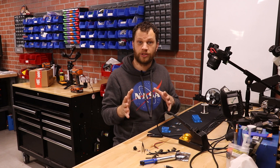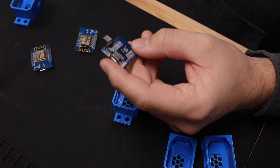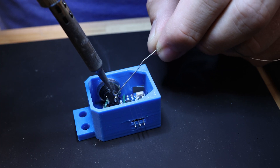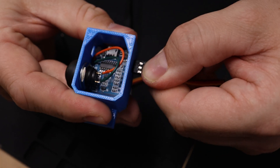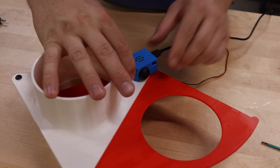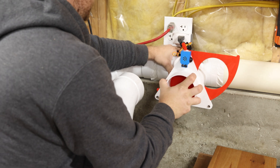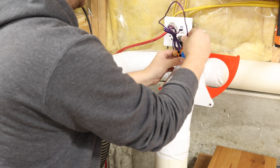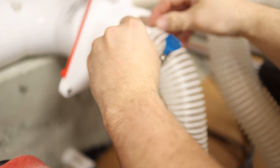Here's what I came up with for the enclosure for the controller. I 3D printed a little case that will fit one of these ESP8266 modules. In order to connect the servo to one of these control boards I need to solder on a header first, and I also need to solder on some wires for the push button that will manually control the blast gate. Once I get all four of these control boards assembled I'll put them on the blast gates. Installing these blast gates, there are a few things I'm considering. The blast gate controlling the table saw was originally on the floor but I was worried about stepping on it and breaking it, so I moved it up closer to the outlet. I also needed to 3D print an adapter that goes from four inches down to two and a half inches, because everything on this table uses a two-and-a-half-inch hose.